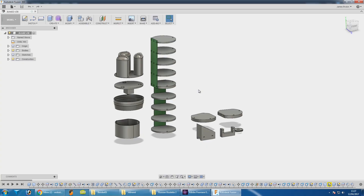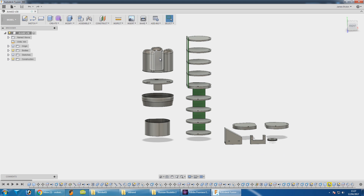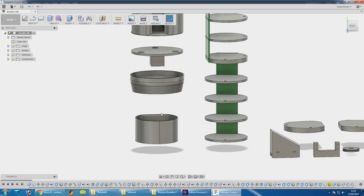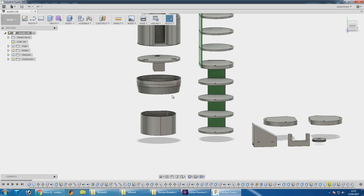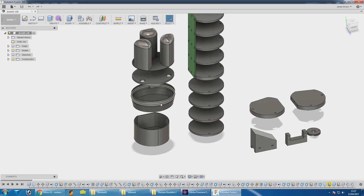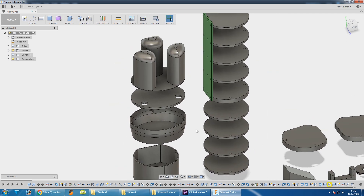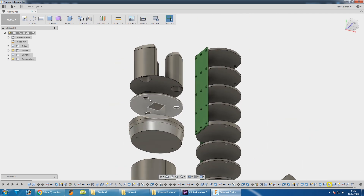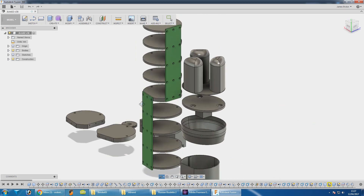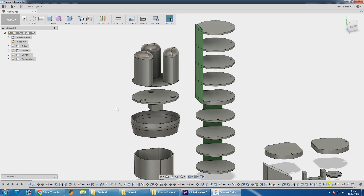Here's Bender's original arm assembly CAD in Fusion 360 and the parts I need to make now for the hand are all on the left hand side. We've got a deep wrist that will take the place of two sections, a soap dish thing that makes the oval Bender's hand attaches to, a plate which fits into that at the surface, and then some fingers. There are holes through this plate - the fingers are again going to be Ninjaflex so they're flexible, and we'll put some twisty ties through there so we can actually pose them and make them grip things.